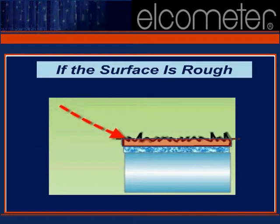For example, if you set the starting point to a smooth surface, and then change the rules by measuring on a rough surface, your thickness reading will be skewed. A coating thickness gauge set up on a smooth surface will understate thickness on a rough surface because magnetic flux lines have decreased their length of travel. The opposite will occur if a gauge set up on a rough surface is used to measure a coating applied to a smooth surface.